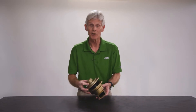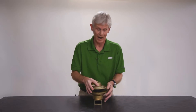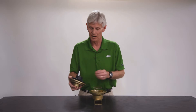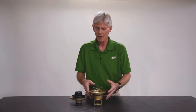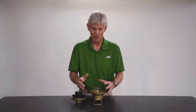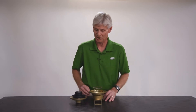I have a two-and-a-half through six relief valve here. I've pulled the bolts out of the cover so that I could take the valve apart and I want to show you the critical areas inside. Customers call me and say they need to rebuild their backflow preventer but don't want to spend money on repair parts if the rebuild won't be successful. I'm going to point out those areas to look at first, and as long as those areas are good, there's absolutely no reason why the rebuild of this relief valve would not be successful.